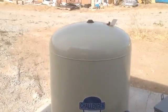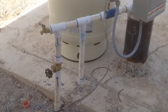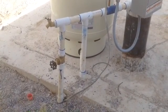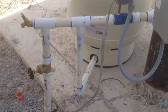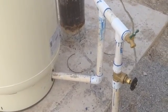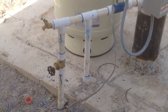This is just the correct configuration. It's not that difficult — if you look it over, you can see the configuration there; it's very easy. This well has a one and a half horsepower submersible pump down there, and it just pumps the water up through the pipes. You have a T there that goes off to the pressure tank. The pressure tanks are already preset from the factory, so when you buy one, you don't have to worry too much — the pressure's already set. You can check it, but it's probably good. And of course, always put a cutoff valve going to the house.